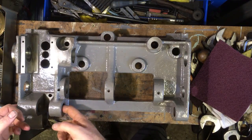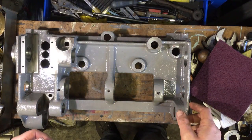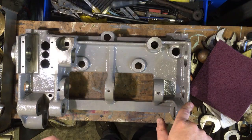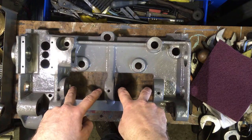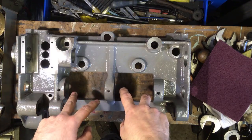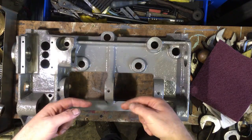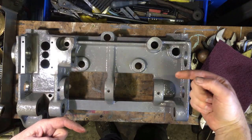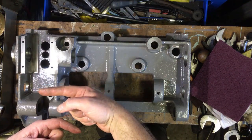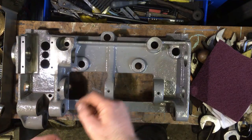I don't think any of these are actually bearings. So I think they're all clearance, but they're tight enough that a coat of paint stops it. So first job is to get the two actuators in, which transfer the drive from the drive shaft running through via a key, and one takes it to basically moving the traverse across for the turning proper, and then the other one covers you for facing.